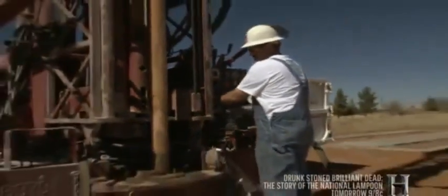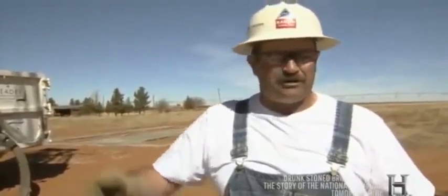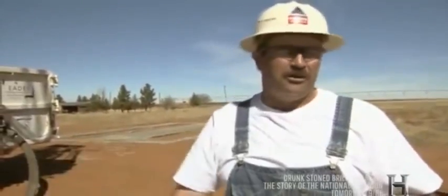But Alan still needs to continue to drill for another 100 feet or so until he hits the bottom of the aquifer. The last 10 years, probably 80% of our work has been replacing wells that weren't drilled all the way to the bottom of the aquifer. The aquifer's just slowly dropped in level, and those wells have started going dry. So now nearly all the new wells we do, we go to the bottom of the aquifer.